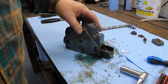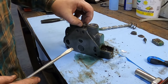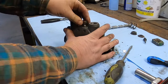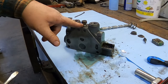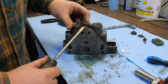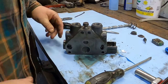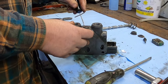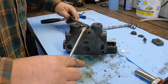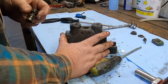These are made by Cessna — I don't think that's any relation to the plane, but someone can correct me if I'm wrong. There is a plug here in between that has some O-rings on it and it can leak. That one on the 4-225 started leaking. The two bolts on the bottom straddle that groove, and that's what keeps it in place. So you pull the bottom two bolts but leave the top ones in and you can pull this spool out. There's an O-ring on there — you can drive it in too far, but it does have a groove in it so you can get a couple screwdrivers on there. There's the O-ring that can leak, so you definitely want to change that out.